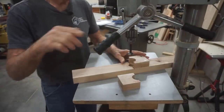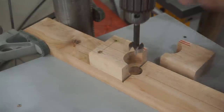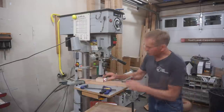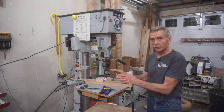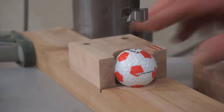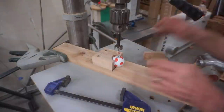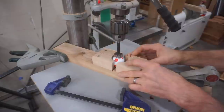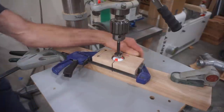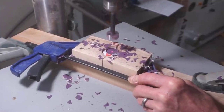Back at the drill press, lower the one inch bit into the one inch hole we just drilled, lock the quill in the down position, and reclamp the fixture to both post and table for perfect alignment while drilling. Now that the fixture's all set up, it's tee time! Take your favorite golf ball and place it in the drilling fixture with the show face down, then use logo marks and writing on the ball to get everything lined up so that the magnet looks right when done — the hole will be oriented just right on the back side of the ball. Make sure to align the writing on the side of the golf ball so it's parallel with the fixture and the logo on the back side is facing straight up. Once you're satisfied with the position, bring the quill down and lock it in position to hold the ball in place while you line up the reference mark on the clamping part of the block, put it in position, and secure it with a squeeze clamp. Then release the quill clamp, fire up the drill press, yell fore, and lower the bit into the ball — be careful to stop when the hole is about an eighth inch deep.